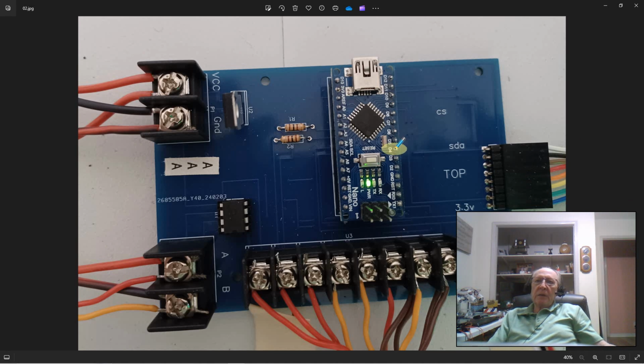So you get these cards, and you can have up to 25 of them. So you can support a good size layout with these readers. By the way, that's what I call them, readers. I refer to them in the hardware as a reader. And you can address these from A to Y. Z is a reserved address that I'm keeping back to allow for something like a global address scheme. As this project gets developed more, somebody may say, hey, we need something where we can broadcast to every one of our readers at the same time. So I held back the letter Z for that purpose. I marked this card with the great big letter A over here, and I recommend, of course, that you do the same thing.